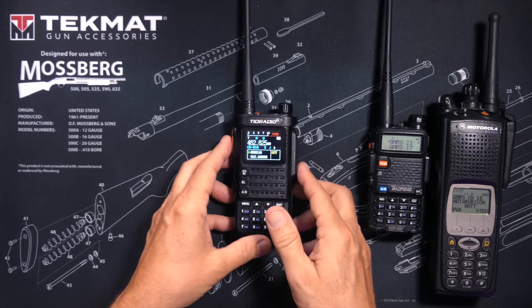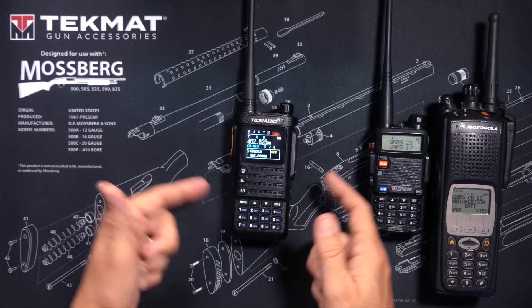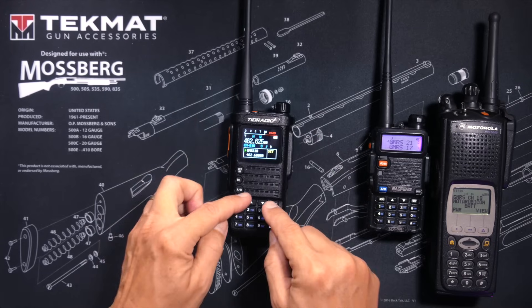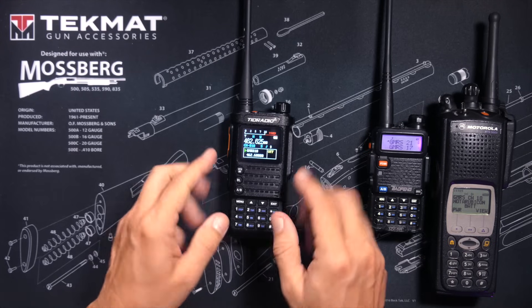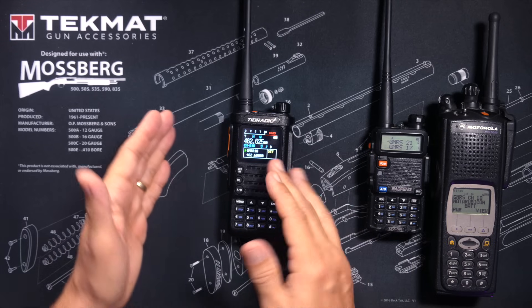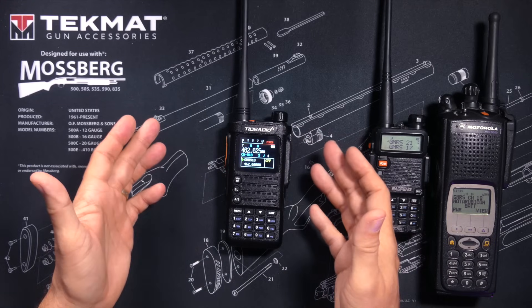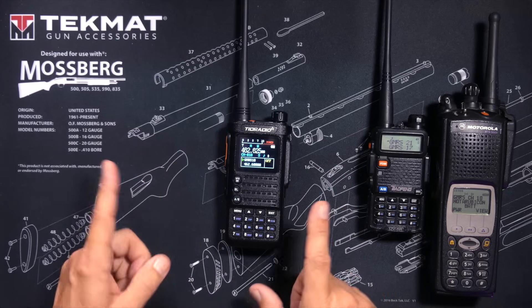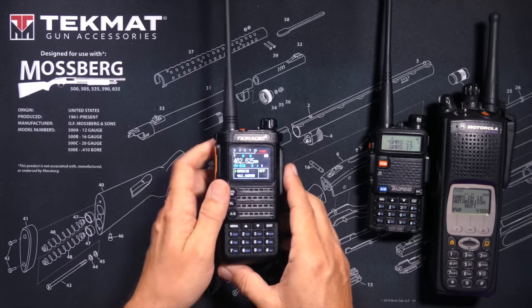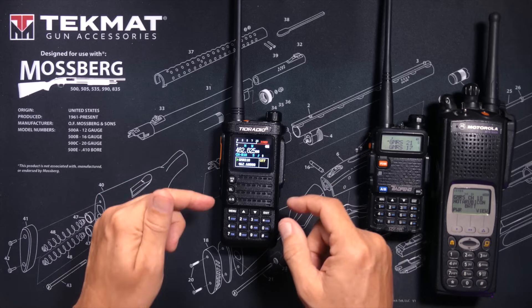This is because on GMRS, according to the FCC, some channels must have limited power output, and some of the channels must transmit only in narrow band, and all of that must be baked into the radio. On a GMRS radio, you must not be able to enter a frequency directly onto the keypad and transmit — not even if that is a GMRS frequency. You can enter a frequency to listen to on the keypad, but you must not be able to type in a frequency and then transmit; you may only transmit on a channel. If it is a mobile GMRS radio designed to be mounted in a vehicle, it must not be able to transmit on GMRS channels 8 through 14. And if the GMRS radio is repeater capable, the repeater channels must be preset using specified frequencies and with a 5 MHz split, and that also must be baked into the radio so as not to be able to be changed.